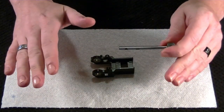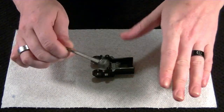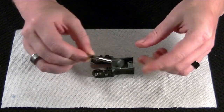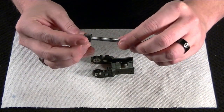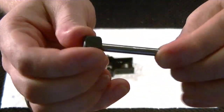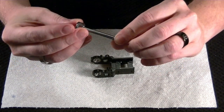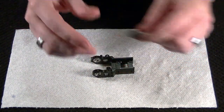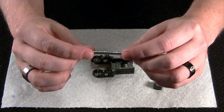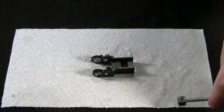So if you guys watched the first video series on how to do the main rotor, you'll understand how to do and grease your thrust bearings and check for the small diameter and the big diameter to make sure they're oriented right. But yeah, this has little dampener rubbers right inside, which is a really cool design. This end is fixed on to it. You can't take it off. So that's kind of cool. You're not going to worry about any set screws or anything like that. But make sure that you grease up the feathering shaft for the tail really well. Get that installed in. You know, get a little bit of grease on the dampening rubbers and everything.